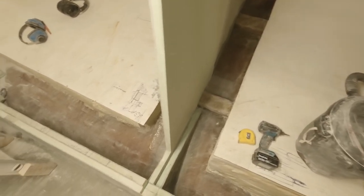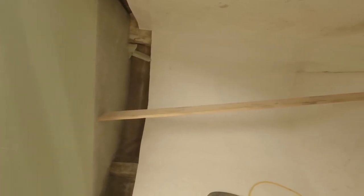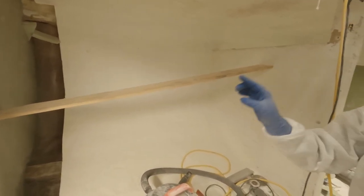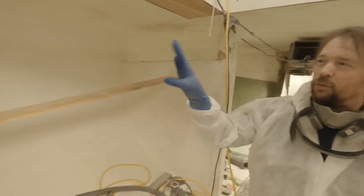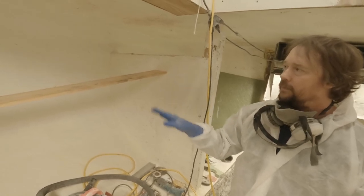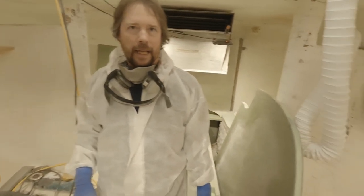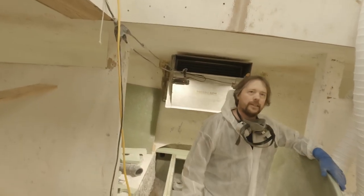It's come together. So this is just a tiny little brace to square that bulkhead up. It's bowed forward about 1/8 of an inch. The thing is really rigid. I pushed on it and moved it about 1/32. So even with just one layer of laminate on both sides, that thing is really rigid. So once there's another layer on that, and then we put reinforcing framing on it, no worries.